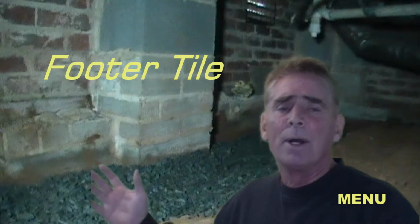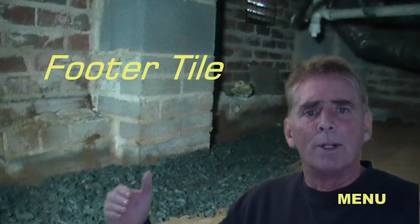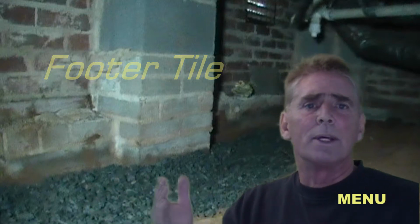And the footer tile, as you can see behind me, is gravel perforated pipe that runs all along the inside perimeter of the wall. As water moves through the wall, it enters into the system and is carried away, usually to the lowest point of the crawlspace, where there may be a sump pump, or it may be a gravity discharge. But let's take a look at installing footer tiles in a crawlspace.